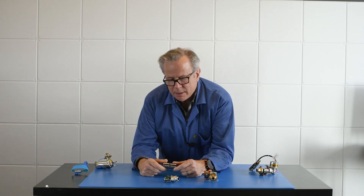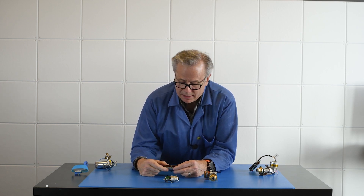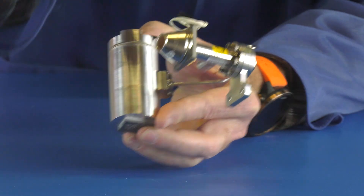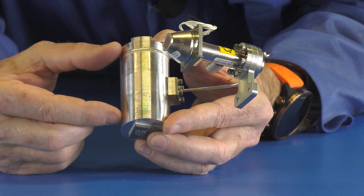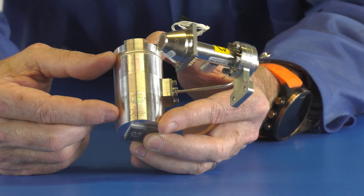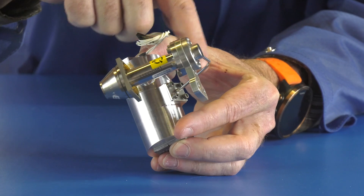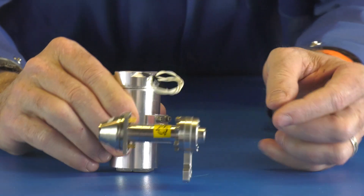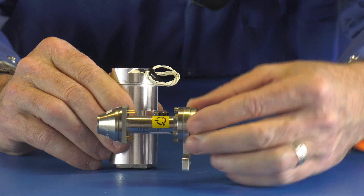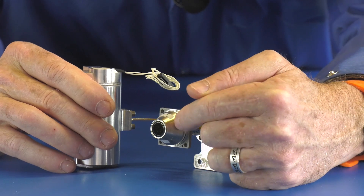The linear motor is a bit more complicated in that it still has a coil and magnets like any other motor. In a complete system, you have the pistons moving back and forth, pressurizing and depressurizing — a linear motor with pressurized helium inside. Helium sloshes through this transfer tube. The regenerator is actuating in its bore, dropping its heat here and cooling the sensor here. The sensor is in this volume — this is the Dewar in this case.